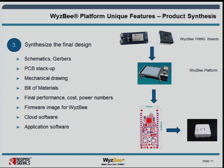It's not because they're not smart. There are a lot of small issues. When they go to a PCB design, then FCC doesn't pass. The performance is not the same. The antennas are different. The routing is different. There's a whole lot of things. And if you really look at it, we already solved them in our modules. Then why should the designer spend another 9 months? That's where we learned, in terms of coming up with this concept.